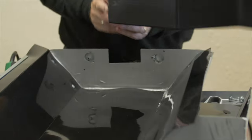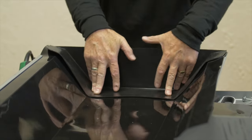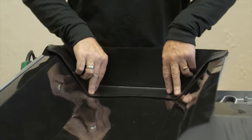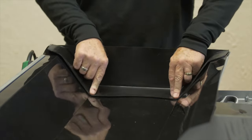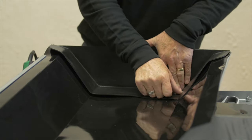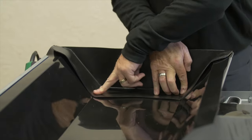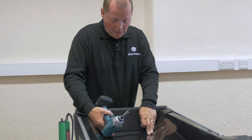Once the liner is pinned in place, we can then place the stop end in and weld it into position. The key to welding the stop end is knowing the weak points, which is always in the crease on the base, so they have to be as tight as you can when you weld either side. Get your stop end into position ready for welding.